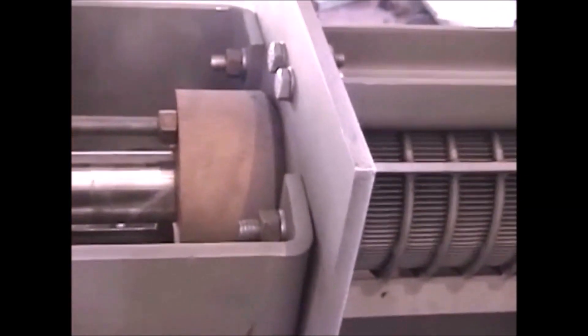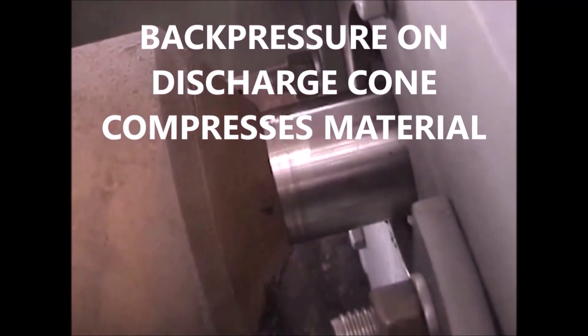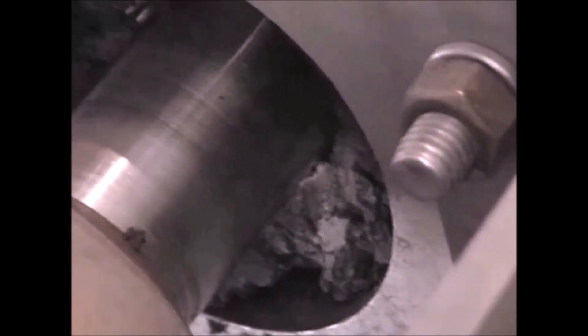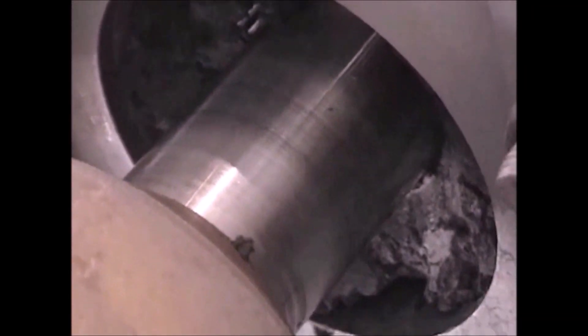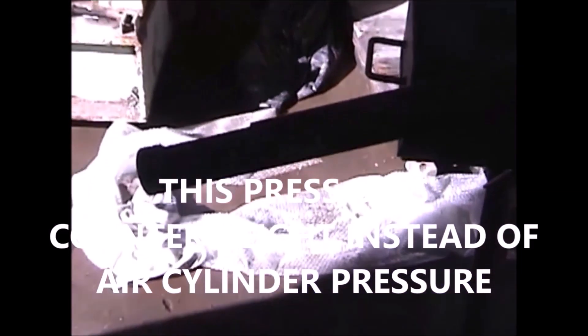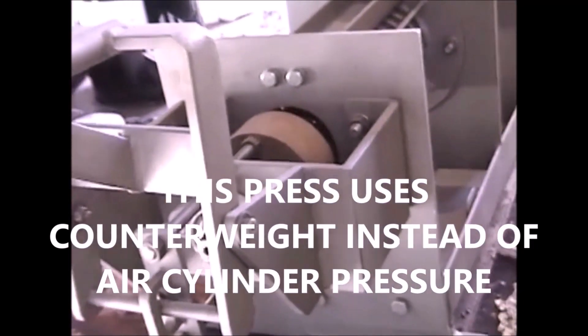I don't plan to collect the liquor. This is a cone — it's made out of brass, it is conical shaped. It presses into the discharge here. The more pressure we put on this cone, the more back pressure we have inside the screen, the more liquid we get out, the higher the horsepower draw. The way we apply pressure is normally with an air cylinder, and this particular machine is set up to have a counterweight that I'll hang off the end here, and that'll push the door shut.